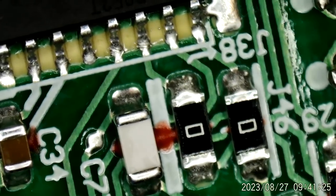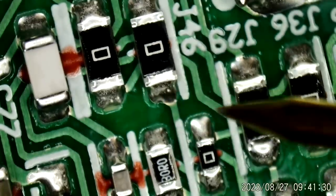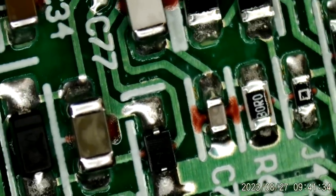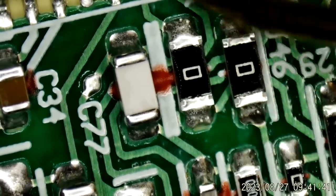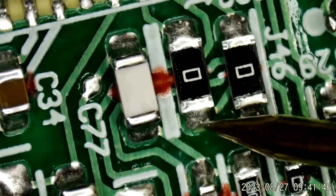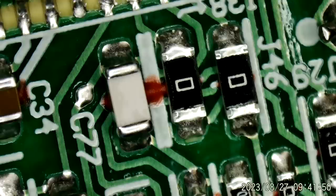Very confusing. Here. A 3-ohm short. Of course, what I may have to do is just lift this. Just see if it's on this side of this jumper or on the other side. Just go ahead and do that. Take some of the guesswork out. Is it the chip?